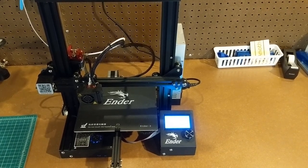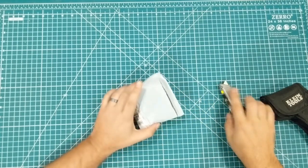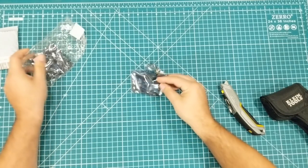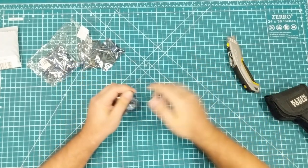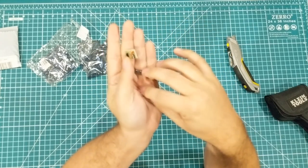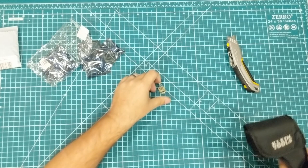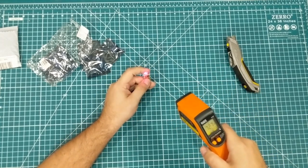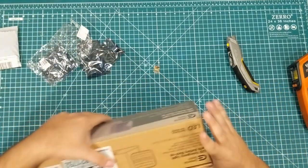Next we have something a little more maker-ish — I got these off eBay. These are laser sensors, and I'm a big fan of them. I've used them in my Duck Hunt project and in my escape rooms. You get a little photo transistor and a small board, and you put the sensor in the three holes and bend them over. They read high when there's no laser and read low when hit with a laser. You can use them for a remote on/off switch, but I tend to use them for games.